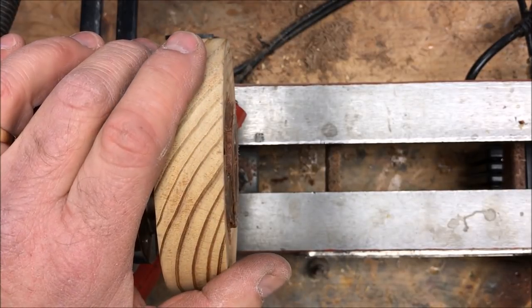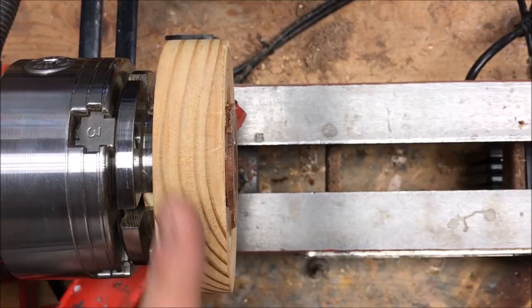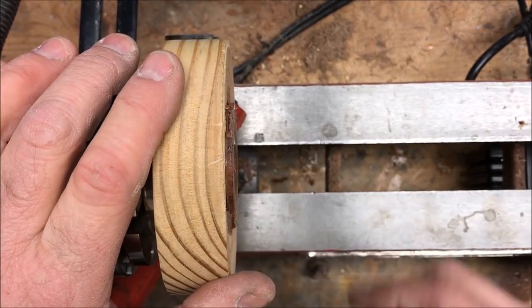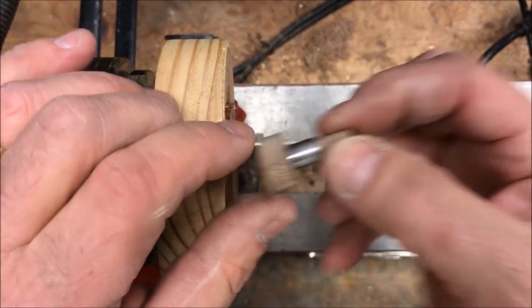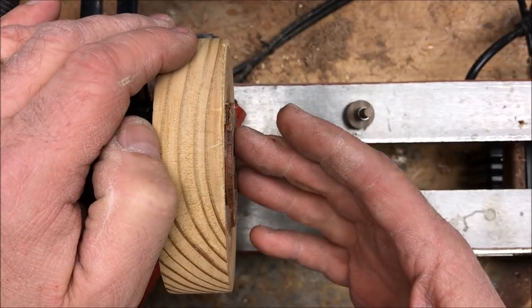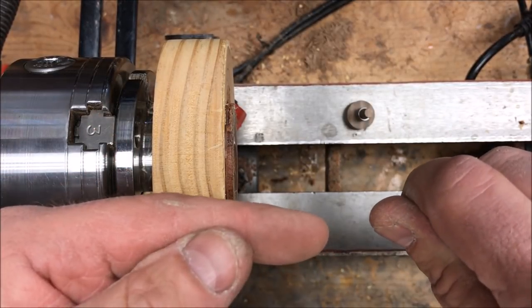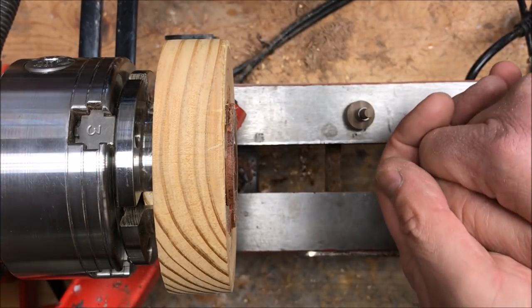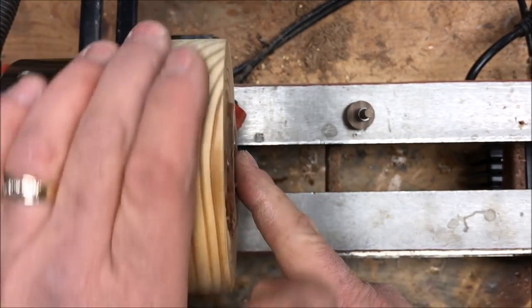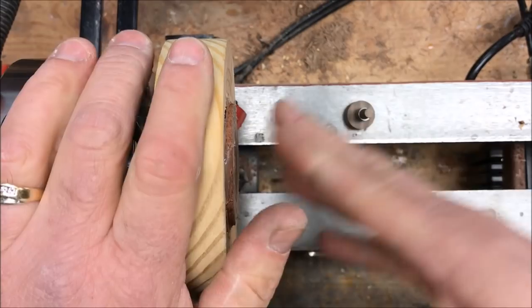I promised I'd show you an alternative method for making one of these finials. I've put my chuck with the sacrificial block of wood back on the lathe — you could also do this with a faceplate, which generally comes with the lathe. I drilled a quarter-inch hole down into the center of the sacrificial block using a Jacob's chuck. If you don't have a Jacob's chuck, you could hot-glue a drill bit into a centered pin blank and drill into the block manually, as long as you hold the bit level. Make sure you're running at the slowest possible speed so that if it catches, you can let go and your hands are safe. I've drilled the hole — it's a decent fit — so I'm going to fill this hole with some hot glue and glue the finial shaft in, and then we'll begin turning.